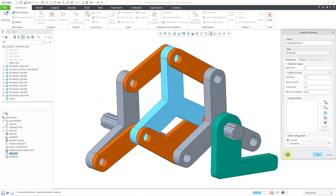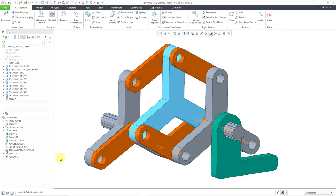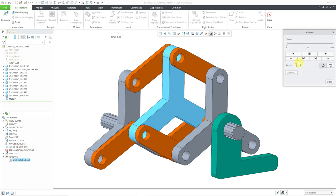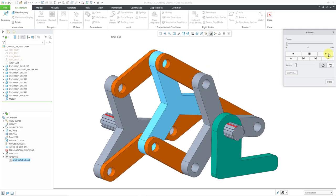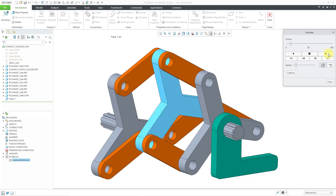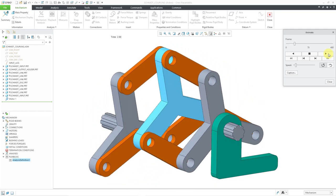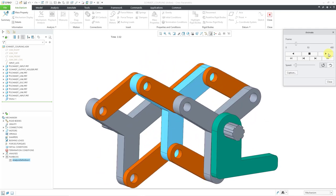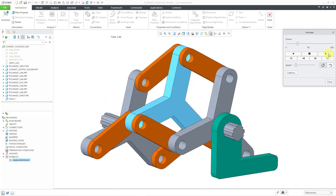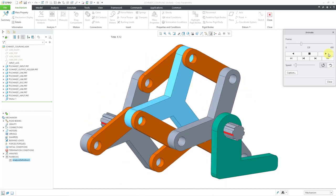Click OK out of here, then go to Playbacks and play that at a bit of a slower speed so you can see how it is moving. The cool thing is, if I change the location of the output shaft, the mechanism is going to update and it's still going to transmit that torque at a constant velocity. So that is a Schmidt coupling — check it out, neat stuff, play around with it.